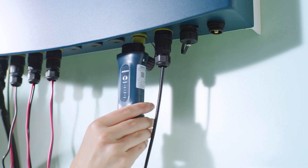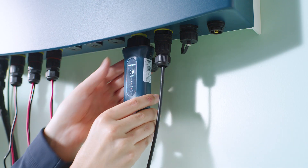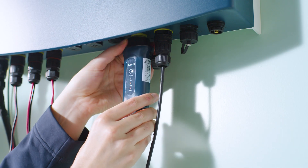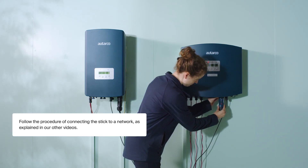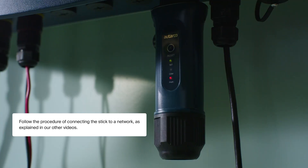Step 7. Install the communication stick in the PELD. Place the stick in the green 4-pin connector port named upgrade. Reading out the inverter information is done through the PELD. Remove communication sticks if they are in the inverter — otherwise the PELD control will not work correctly. Then install a LAN stick D or another one of our sticks in the PELD.